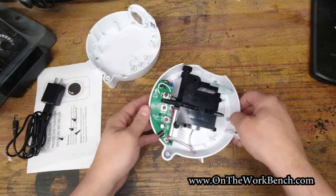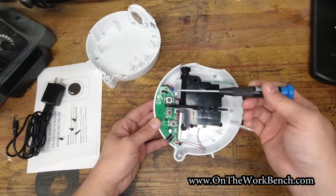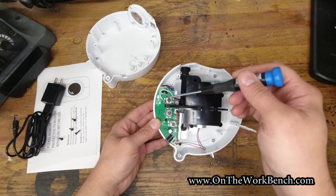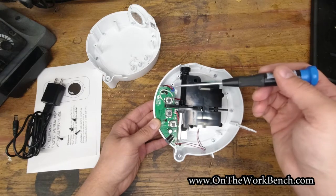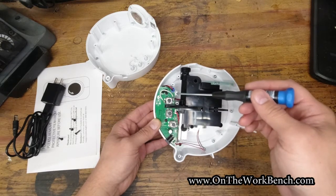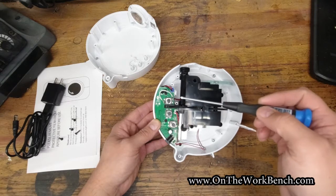Make sure it's clean. This switch here — the one closest to the projection lens, which I'll call the top — I've gone through and found a jumper wire and soldered it from the upper right corner to the lower left corner to effectively bypass this momentary switch, so we can make this smart. Now you don't have to press it to turn it on; all you have to do is add power to it. Just a short little loop of wire and a bit of soldering, and that's step one: modifying the inside of the case.